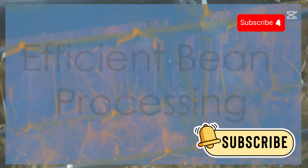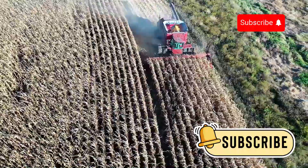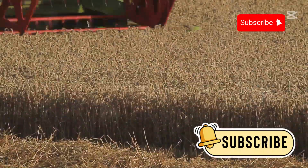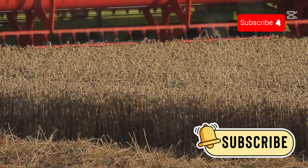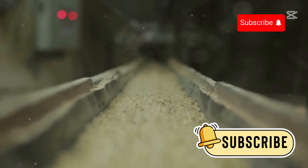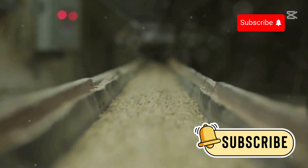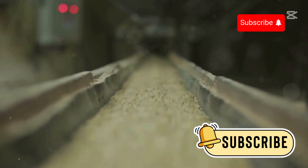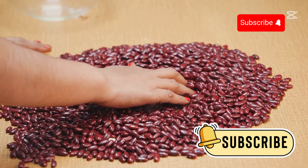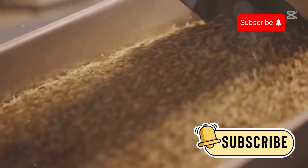Farmers also use dry bean threshers. The dry bean thresher moves along the rows to harvest the bean plants and then transfers them to the threshing unit. When the bean plants pass through, the rotating shafts hit the pods, separating the beans from the pods, similar to when we use a pestle to pound. After being separated from the pods, the beans continuously pass through a shaking and sieving unit to remove any remaining debris, resulting in cleaner and more uniform beans. The clean beans are then transported by elevators and conveyors and poured into containers.